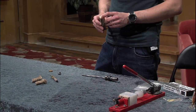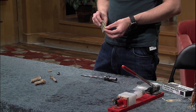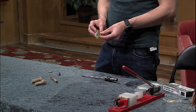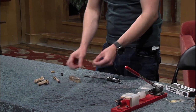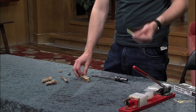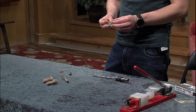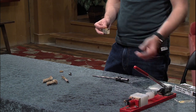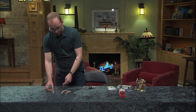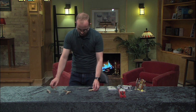Once there's a hole inside of the material, you're going to stick the tube inside of the material for a test fit. This will go through completely, and you'll be able to see on both sides there should be a solid hole, and the piece of material will line up flush with the tube. After which, you pull the tube out, and you're going to apply a CA glue finish around the outside of the tube, and you're going to have to work quickly because the CA will cure in seconds. You stick the tube inside of the wood, making sure that it fits flush, and then you take a bottle of accelerator and you spray the outside of both of the materials. You set the blank aside for a moment to dry, and then you work on the second part of your project. So in this case, that would be the piece of antler that I have.